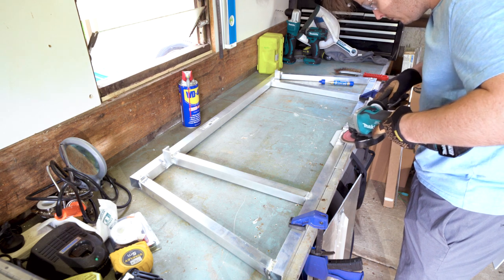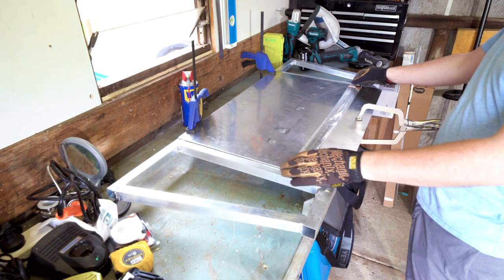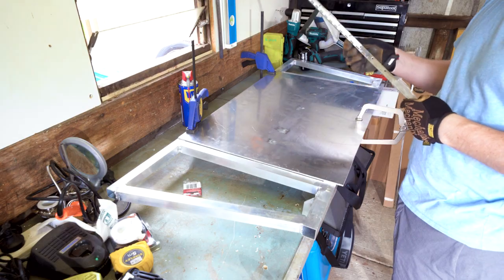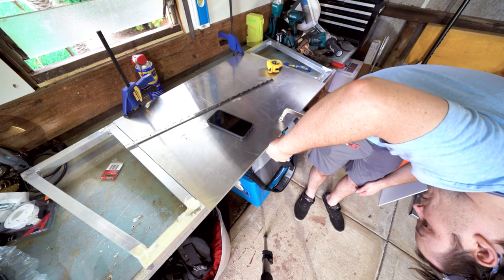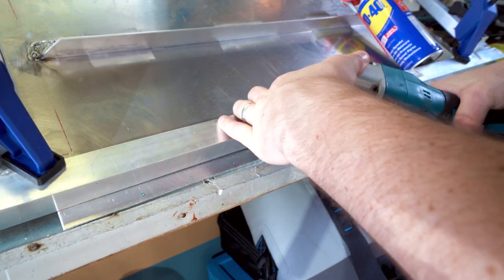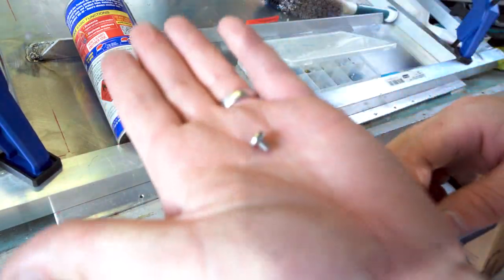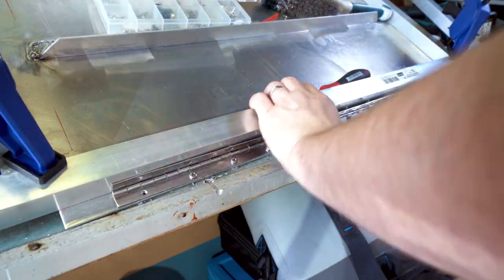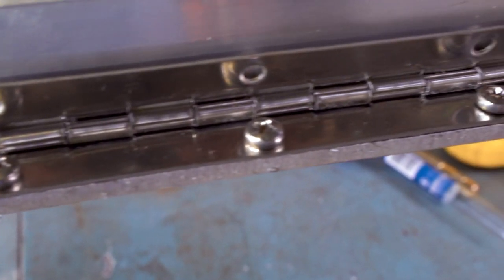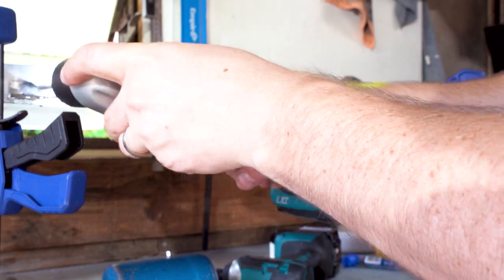As a newbie welder, most of my welds needed a clean-up with the angle grinder. The hatch may look a little oversized but the overhang at the front of the frame allows for a hidden piano hinge. This is totally unorthodox — if I had my time again I'd do it differently, as I cannot mount anything beyond the hinge edge without interfering with its movement. To secure the hatch I drilled and tapped a series of holes into the sheet. With the hatch firmly held against the frame I could pilot-mark the hole positions to be drilled to 5mm so the hinge could be riveted in place.